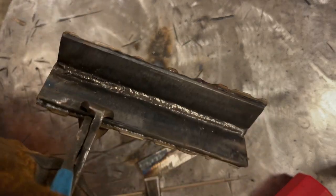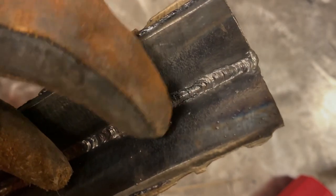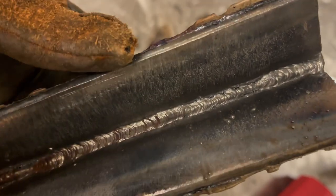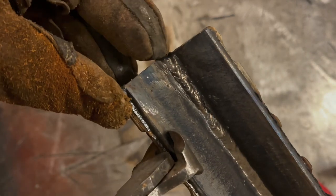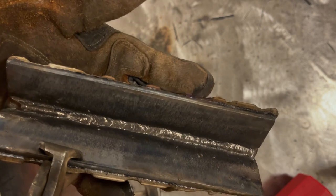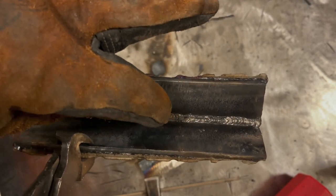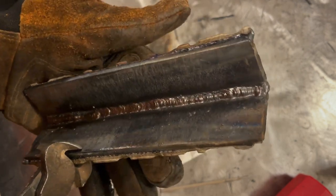There's still some slag I gotta remove in there. Like you can see some on the toe there. But overall, once I got it laid down in there, you can see it looks pretty good once I finish cleaning it up. I welded over the end just to kind of flatten it a little bit more and clean up in there. But you can see by downsizing the rod and running it on the hotter side, because that rod's able to get down in there a little bit closer under a more controlled arc gap, it just flat out welded better.